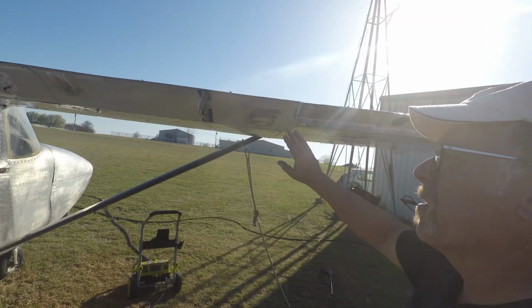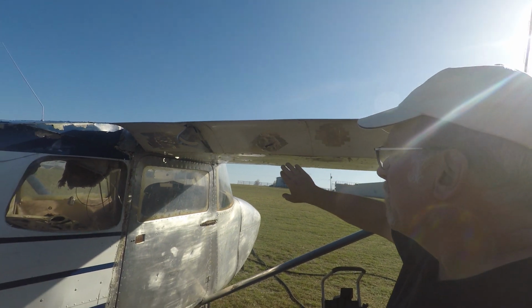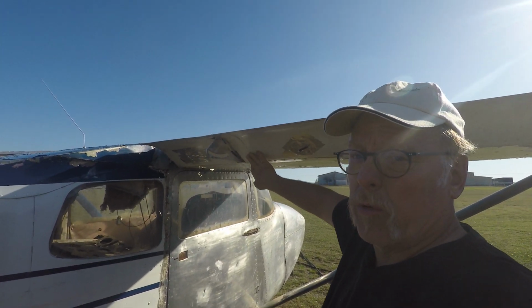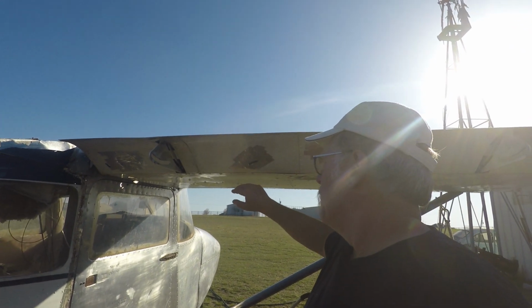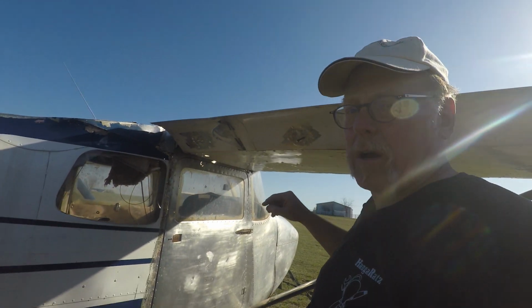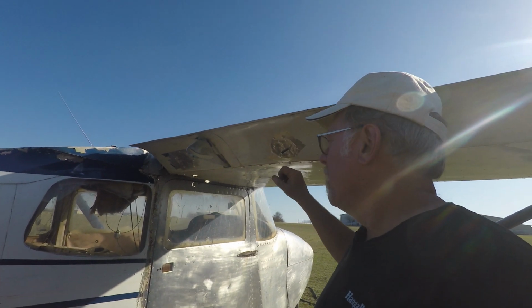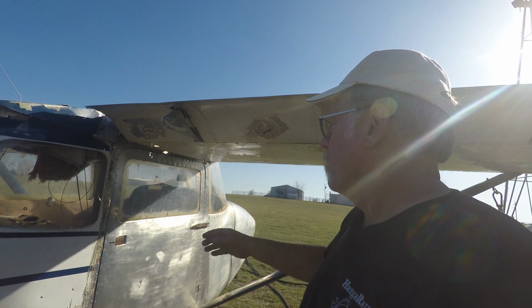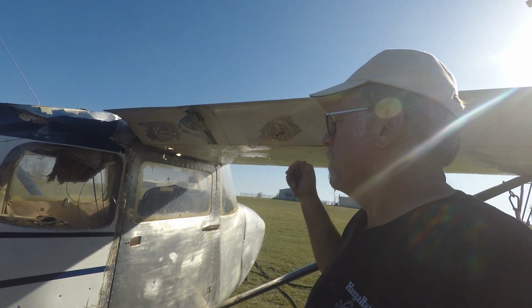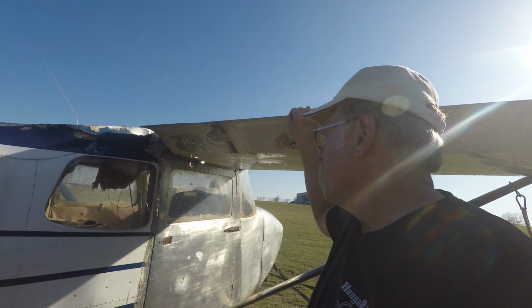Coming around here, the flap cove, it's got a big old Siamese patch thingy here to here. Something went on here really pretty bad. There's some 3/16 inch bolts in here. I don't feel good about this, not one bit. So what we're going to do is I've got to take out the spar. So hopefully either we or somebody will be putting a new inboard rear spar in as a minimum, in addition with the upper and lower skins.